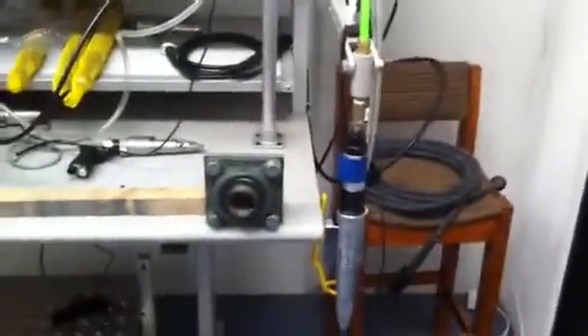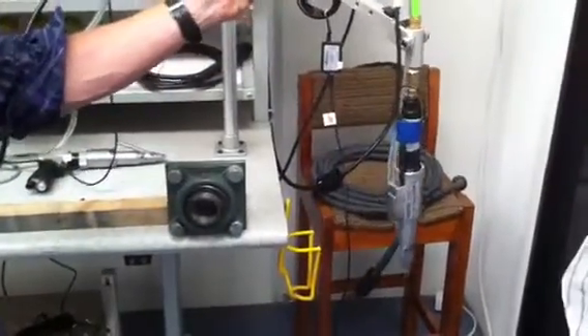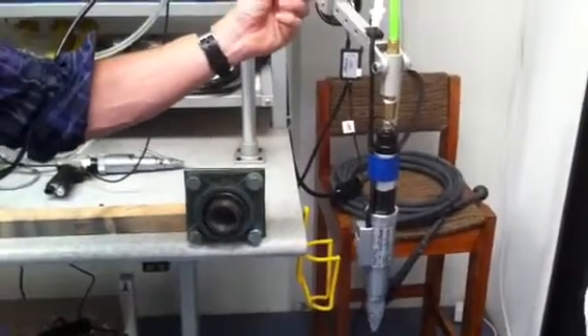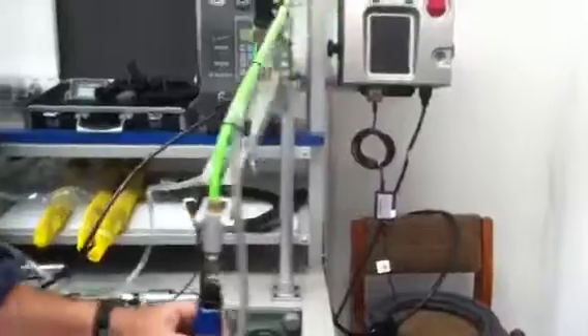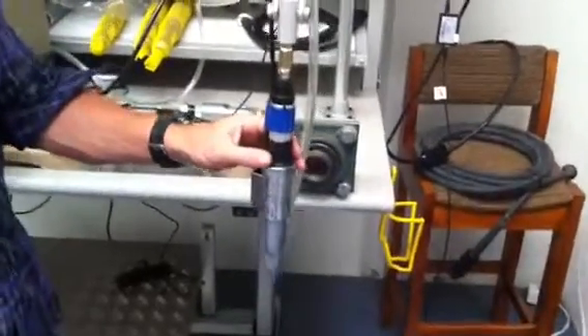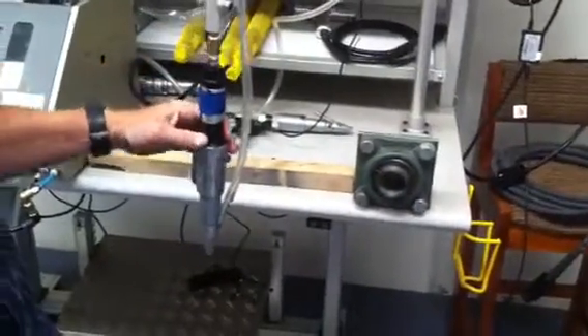So that's basically the system structure. We do have a lot of variations on the arm — it's fully adjustable as far as length and reach. It's pneumatic, and we have spring-loaded types as well, very similar. And usually the screwdriver is good for a couple of million cycles, so there's not too many problems with wearing parts and things like that.